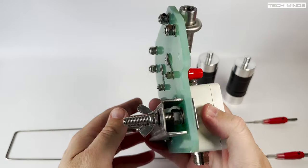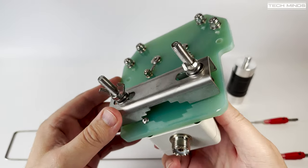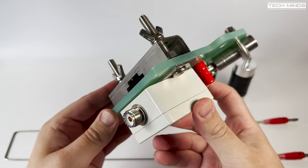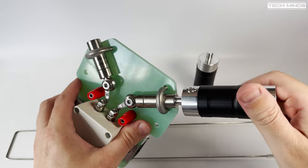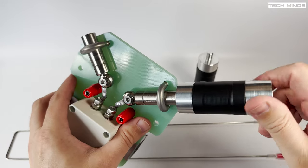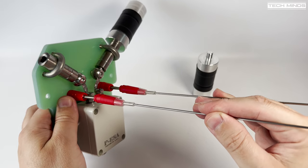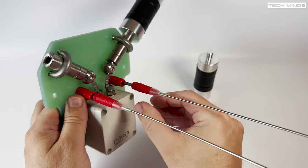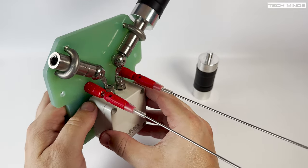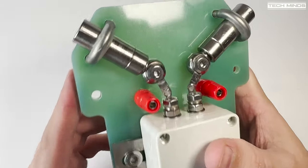The bracket appears to be made out of some form of thick plastic, maybe acrylic, but I'm not 100% sure of the actual material. When wanting to tune for the 40 meter band, the induction coils are simply screwed into the antenna threaded sockets, then the telescopic antennas screw into the coil. Also provided is a 40 meter matcher which just slots into the provided sockets. I've not seen these type of matching contraptions before, so if you know electrically how these work then let us know down in the comments.